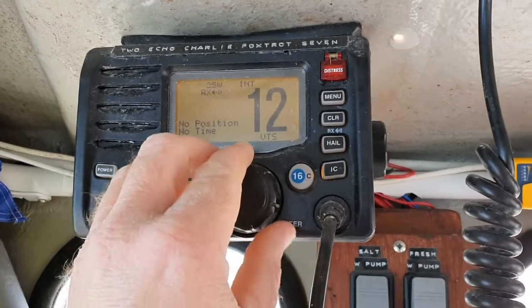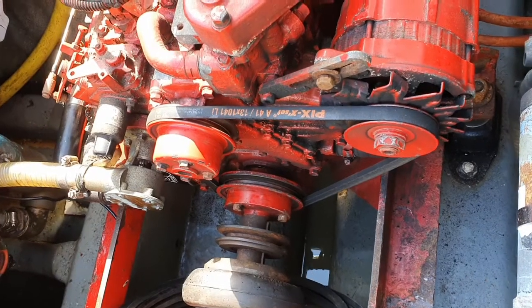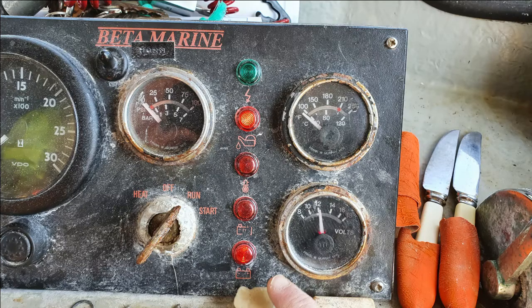Once the boat is running again, you can release the diver and call VTS or the Coast Guard and stand them down. The V-belt on first light runs the freshwater coolant pump and the alternator. You will know that it has gone immediately with the audible alarm as the alternator stops running and charging, and slightly after this as the engine overheats.